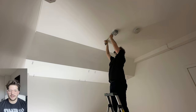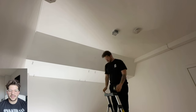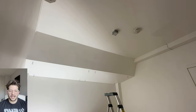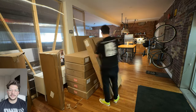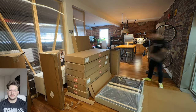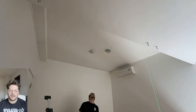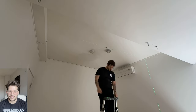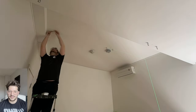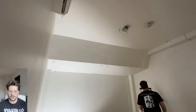I mapped the laser reference on the floor with a piece of masking tape and I can use the feature on the laser that shoots a dot down and up, so I know exactly where my reference point is going to be on the ceiling. I use that to get all of my hardware markings for this middle row of clouds. This middle row is going to be angled down towards the steep portion of the bulkhead, so the hardware is going to be a little bit narrower on the panel and on the ceiling than it was for those first two clouds. I'm marking everything out, using the laser to make sure that everything is nice and straight, and I can use it to cross-reference all of the other pieces of hardware to make sure everything is in a nice straight line.